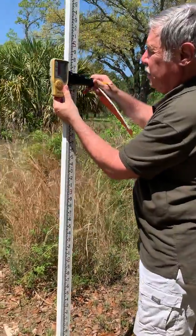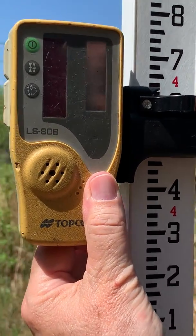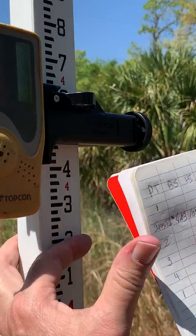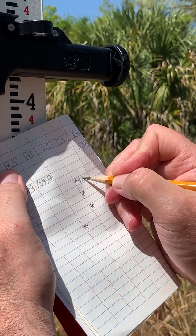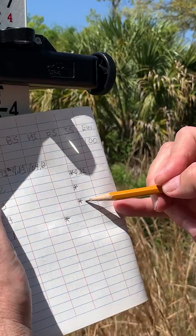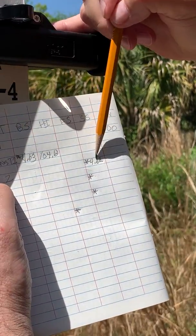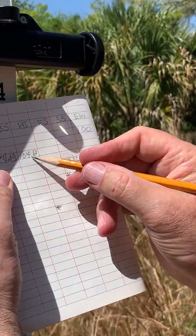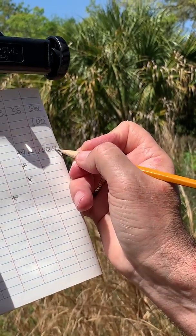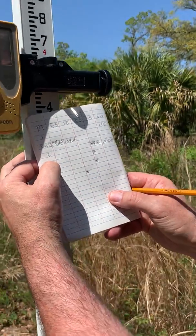As we heard the chirp, we actually picked up the spin of the beam, looking at the sensor's up and down arrow. We're coming in and locking off 462 as our reading. So we're going to take that 4.62 and mark it at the location of point number two. The back sight and the side shot are approximately the same. If we do the math, 4.62 from 104.63 gives us an elevation of 100.01 — so it's almost exact. Remember, a hundredth is about an eighth of an inch. We're going to proceed to point number three to take a side shot and get its elevation.